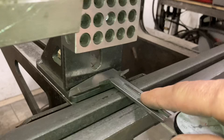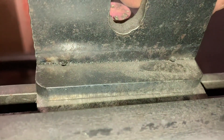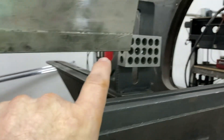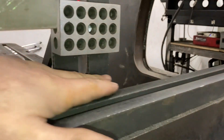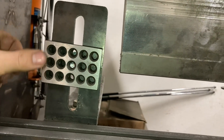So I put this on here and make sure that it's even, because there is a tiny bit of wiggle in that slot. I make sure it's even all the way across. Depending on how long the part is — this part's about 18 inches long that I'm bending — I'm going to use both of these stops. I make sure that it's absolutely straight on both of them so you don't end up just hitting one edge and throwing off the measurement.